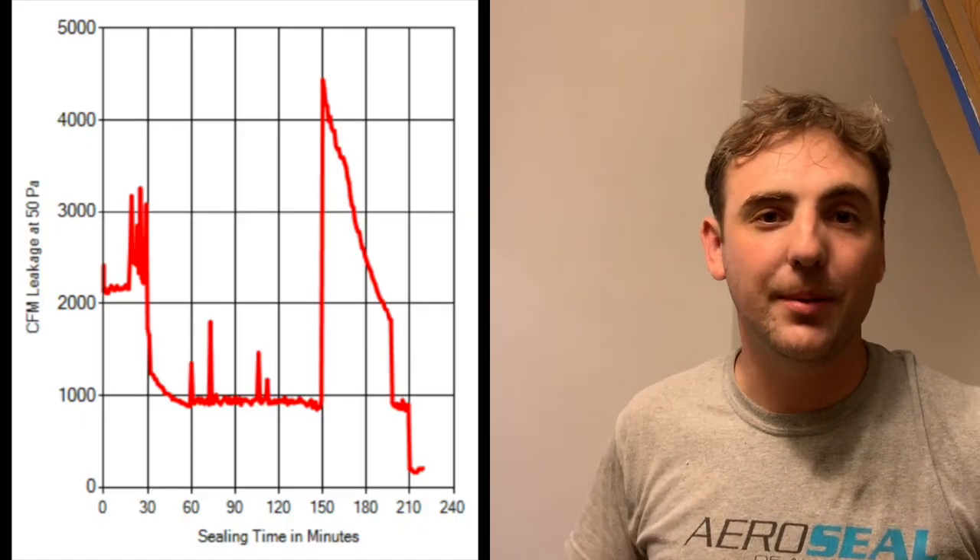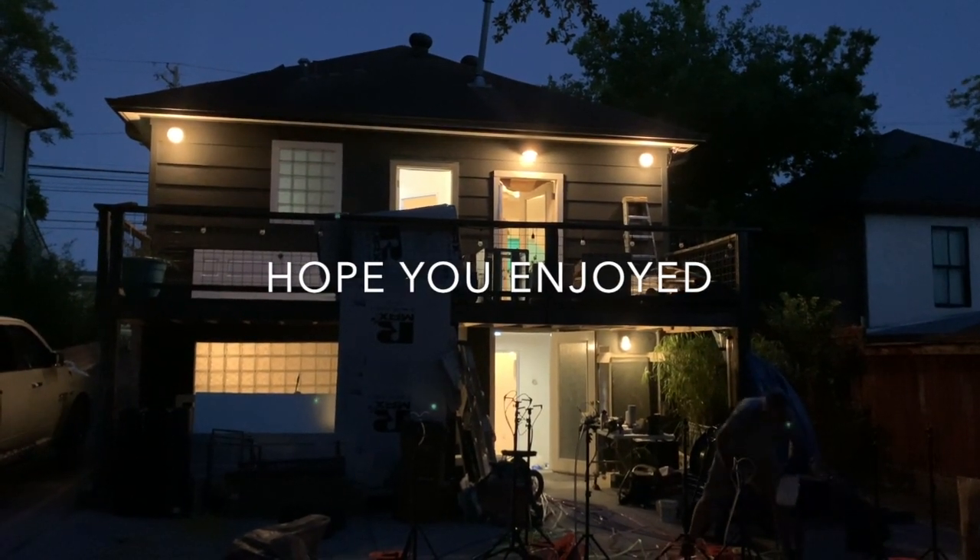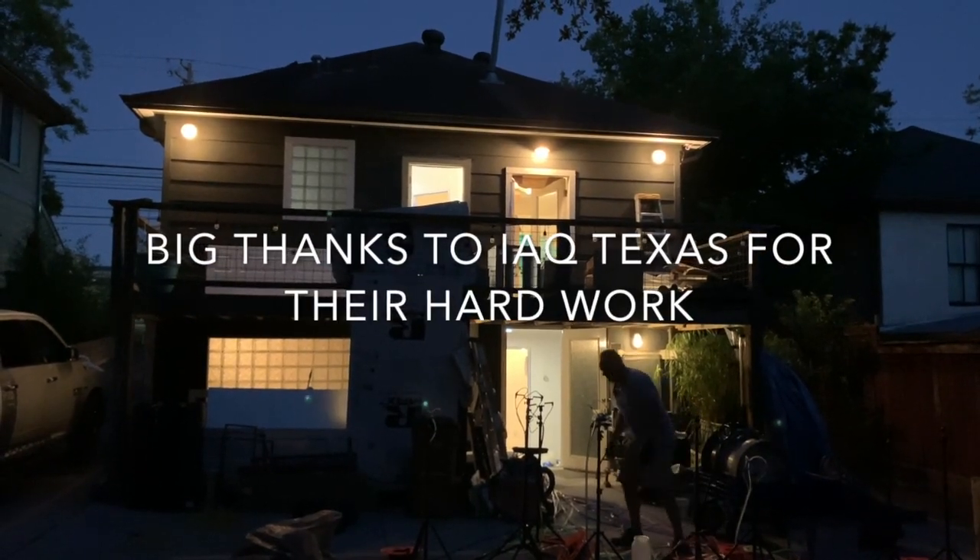It's the end of the day. We're doing our final blower door to see what we actually hit. We've been AeroBarrier-ing this new office for Positive Energy all day and we finally got done. We basically got down to 0.68 ACH50 with all of the windows, exhaust vents, and everything taped up. We took down all of that and did a regular blower door — apples to apples — and the 0.68 ACH50 increased to 3.26 ACH50. Some tape wouldn't stay on and there are some holes still open to the attic. Once Positive Energy gets all of their holes figured out, we'll do a real final test. But we took the house from 9 ACH50 initially down to around 3 ACH50 — a significant improvement.